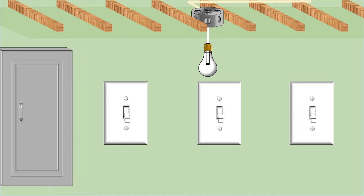The big difference between three-way switches and four-way switches is that with three-way switching combinations you have two switches — one at either end of a hallway, one at the top of the stairs, bottom of the stairs — but both of the switches control the same light. Now in a configuration there can only be two three-way switches.